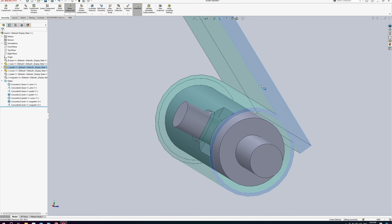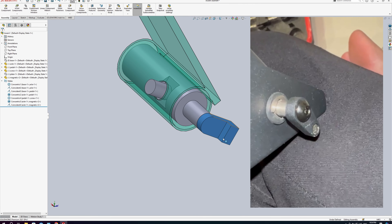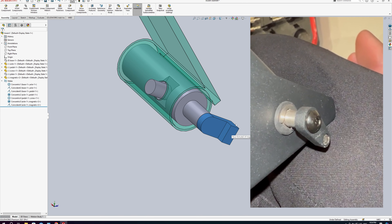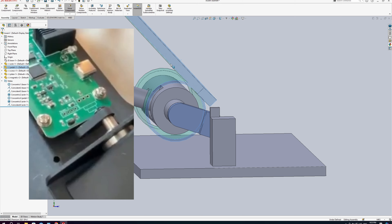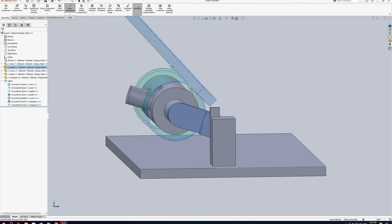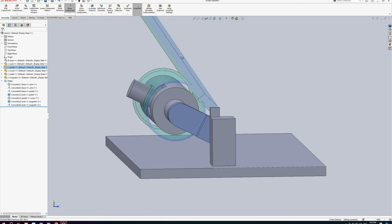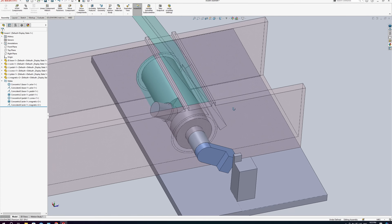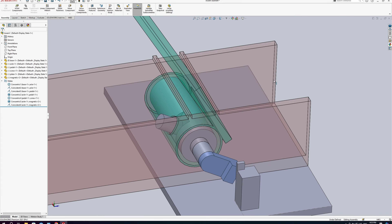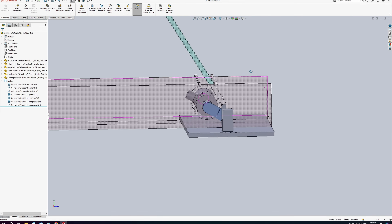At the end of the axle there's a magnet. The magnet interacts with the hall effect sensor here. When the magnet moves closer to the hall effect sensor it picks up more value — when you press you get more value, and when you release the value goes down. The last component is the pedal base, which holds everything in place. Now you know all the components and how the CP5 works.